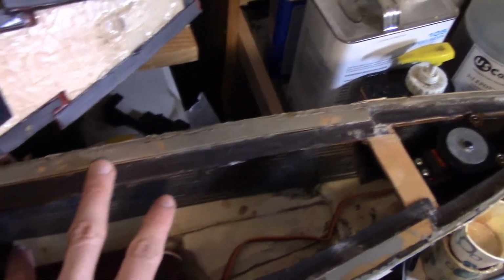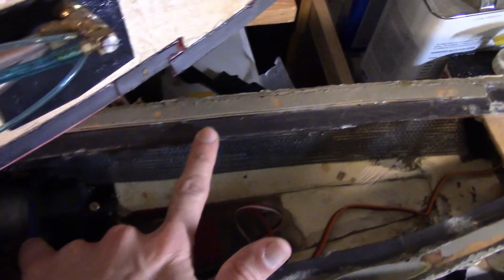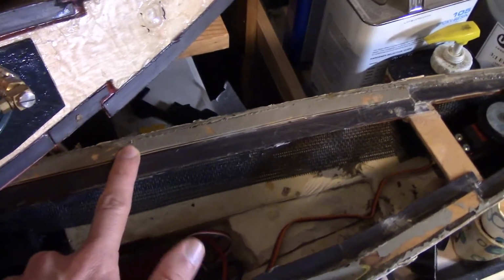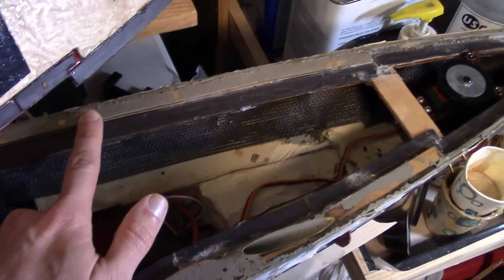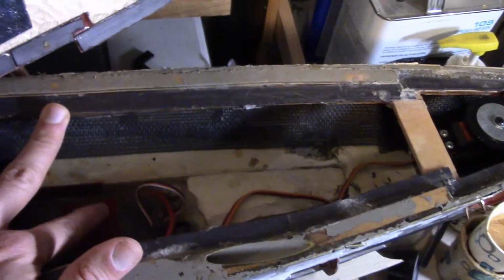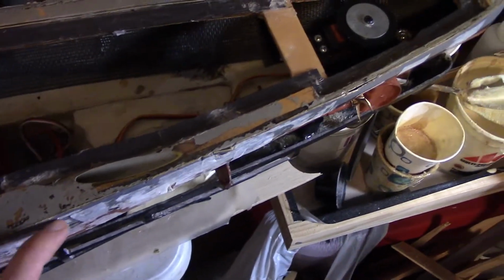And then on the deck rim, this top piece is actually 1/4 inch thick, because of accounting for the thickness of the magnetic tape, which if there was no adhesive, it would only be 1/8 of an inch, so you could make this 3/16, and I've done that on other boats before. But once you add the adhesive, I found it's better to have this as a 1/4 inch when all the thickness adds up. And then underneath, the subdeck is actually 3/16, so the total thickness is thicker than 3/8 here. But what I did was I just tapered the outboard edge, so where the assembly attaches to the hull, it's only 3/8 inch thick to not violate that requirement.